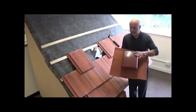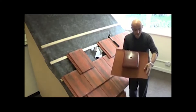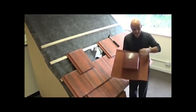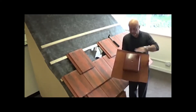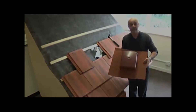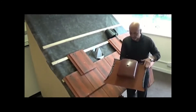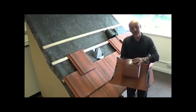Before the universal tile vent or terminal is put into the roof space, we need to shape the UbiFlex skirt by turning it over on itself on the two sides and at the top to create a water barrier for wind-driven rain or snow. The UbiFlex is now folded as stated at the two sides and at the top, and we're ready to install.